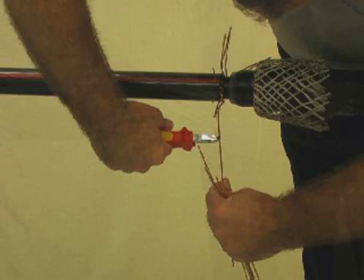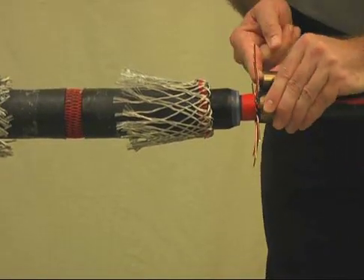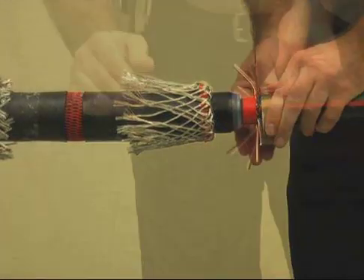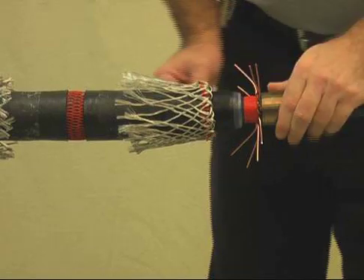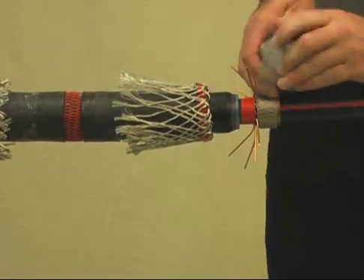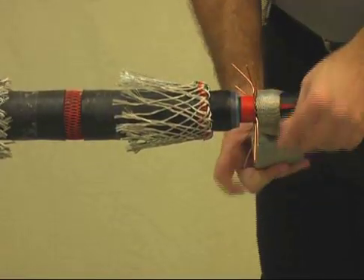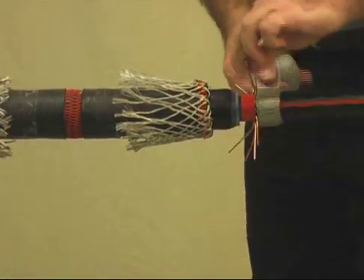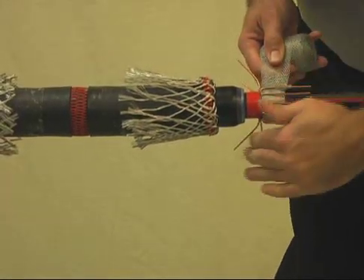To avoid having neutral wires exiting the splice, it is possible to run an external ground using the ground braid provided in a Tyco Electronics external ground kit. Install the small F-size spring clamp at the jacket cutback directly over the cable jacket. Wrap four turns of copper mesh over the installed spring clamp. Lay the neutral wires back over the cable and press tightly against the copper mesh.